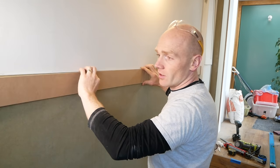Wood glue, I just use this D4 stuff that I already had. Just make sure that if you're using a weatherproof or outdoor type glue, that you wipe off any excess, because paint just struggles to take anywhere there. So make sure you're wiping off any squeeze out.